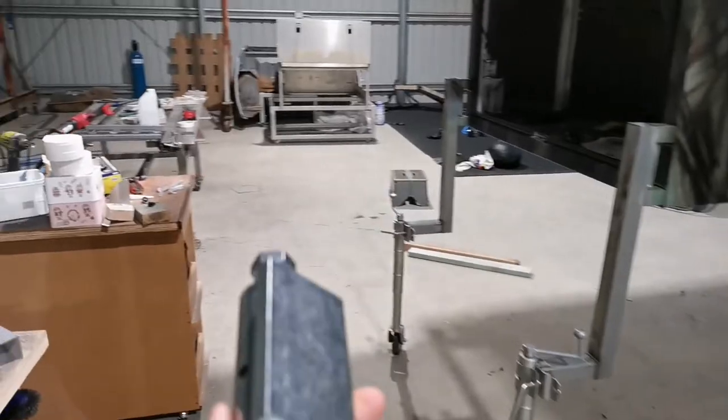Alright, to build a swing arm spare wheel carrier, you've got to have a really, really strong hinge. There are not many ways that you can build a swing arm. I've considered going online and getting myself a swing arm kit, but I honestly don't want to wait any longer for this project to finish. Alternatively, some people use a trailer axle, what they call an axle stub. The axle stub is rated for whatever ton, so it's really heavy too, so you can make sure that it works pretty fine. You've got to find a wheel hub that has no flange, and that is really challenging. I think in the old days you can still find some flange-less wheel hub, but I can't really find it anywhere anymore.